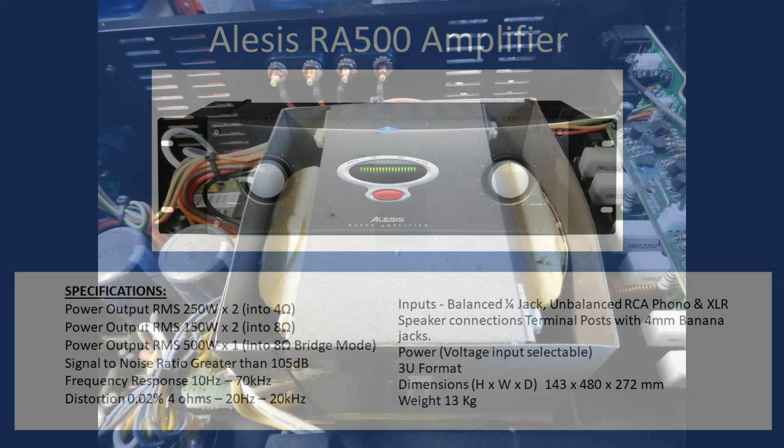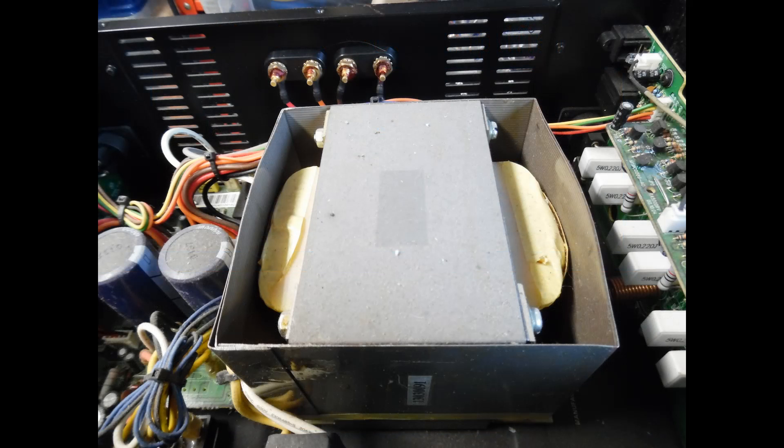Let's take an overview of the amplifier and what the issue was when it came in. Looking from the front, you can see the amplifier is extremely dusty, which is normal because the top grille has multiple slots covering the whole amp. Over time dust and dirt falls through and coats the circuit boards. As with all these amplifiers when they come into the workshop, the first thing you need to do is give it a clean — a stiff brush, long hair brush, or maybe a compressed airline.